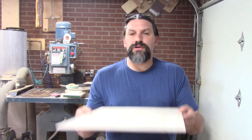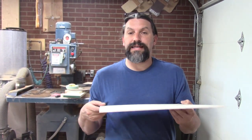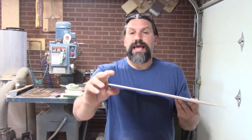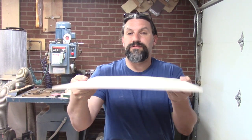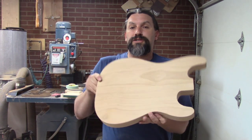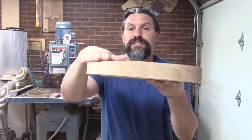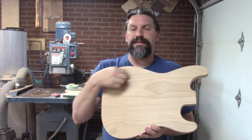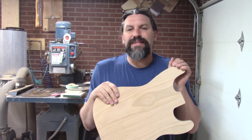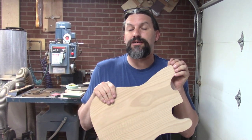A while ago I made a video where I showed you all how to make a bookmatch top, and in the case of the one I'm holding now — the one we used in the video — it's about an eighth of an inch thick, and I alluded to the fact that I want it to be flexible. The reason we want it flexible is, as a lot of people have already guessed, we want to bend it over the forearm contour of a Stratocaster-style body. You could put this on a flat body and then put the contour on there and just have a line that doesn't have flame maple, but I think it looks classier and sexier if you bend it over the contour. So what I'm going to do today is show you how to do that.